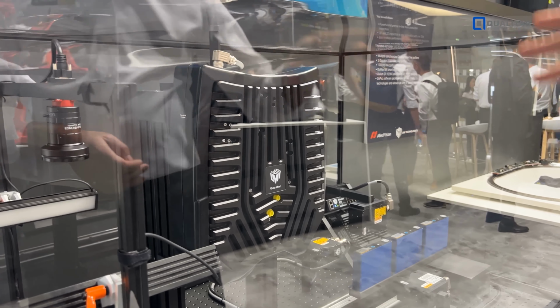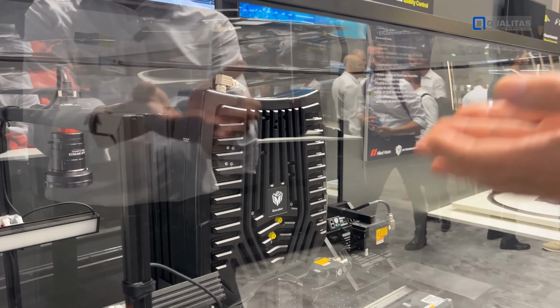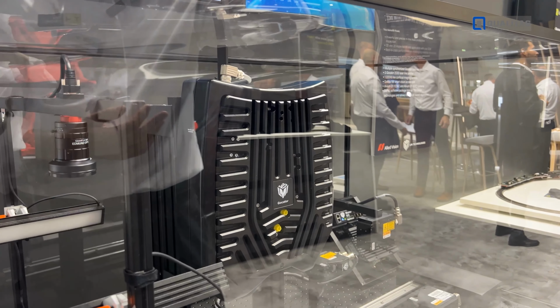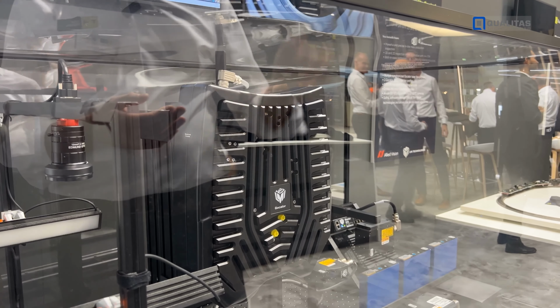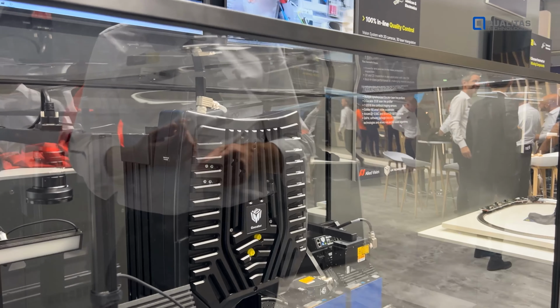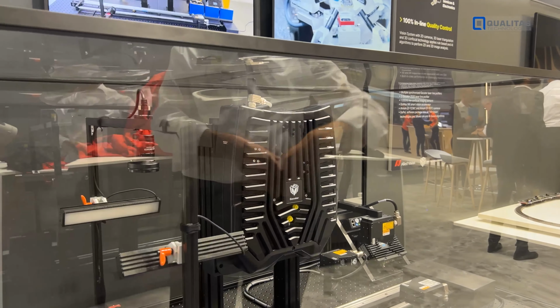So you get more from curves, you get more from the jumpers, and if there's a groove or a scratch, you really get also the sidewalls. Right. And the G4 series, our new confocal scanners with very small arrays, can even get up to 80 degrees surface curvature. Wow. So there's no blind spots, no shadowing. It is coaxial, going through a semi-transparent mirror, so looking from the top with the light, with the camera, and there you can go up to 80 degrees.